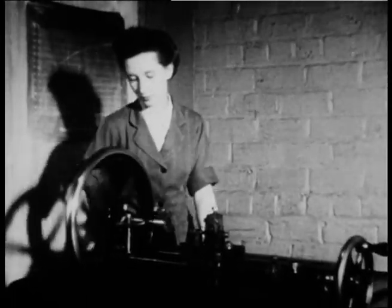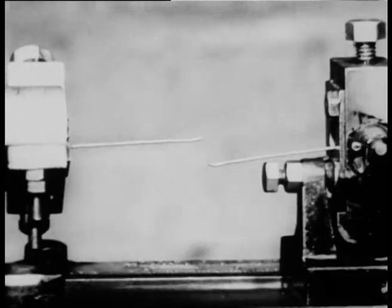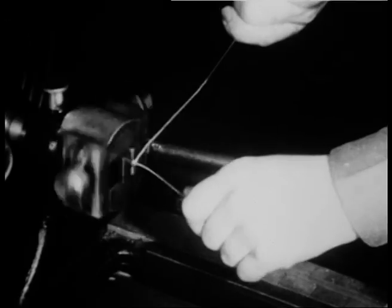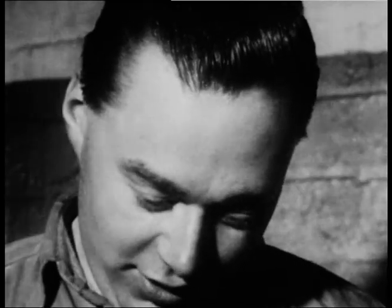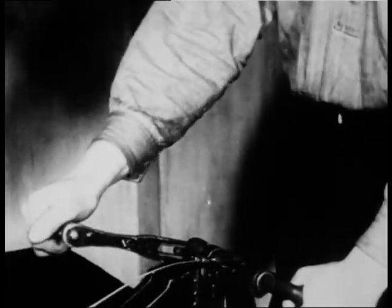The torsion test is usually taken on a length 100 times the diameter of the wire. The number of twists varies according to quality. In the wrapping test, the wire is wrapped on and off itself until it fractures. Thus, the ropery, as well as the wire mill, has satisfied itself about the suitability of the wire for the purpose required, in this case, for an excavator rope.